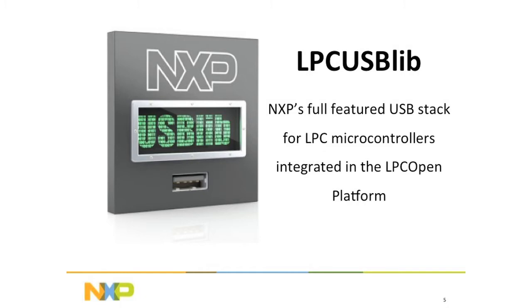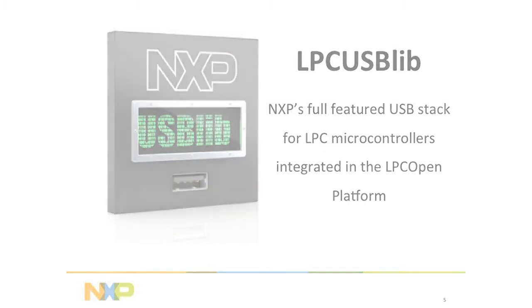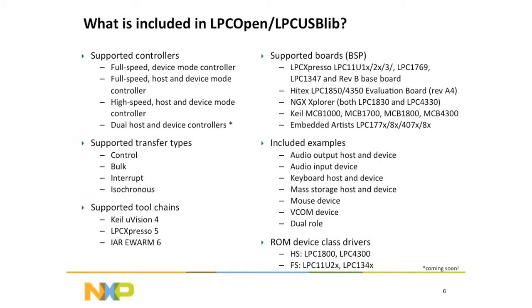It's nice to have a little M3 or M0 micro, a very small, cheap part that has USB on it, obviously. So today, I'm going to show how you can measure the bandwidth of one of our full-speed USB devices on our micro. We provide a USB library stack. It supports both host and device mode, and it works on our high-speed and full-speed devices, and it does isochronous as well as the other transfer types,